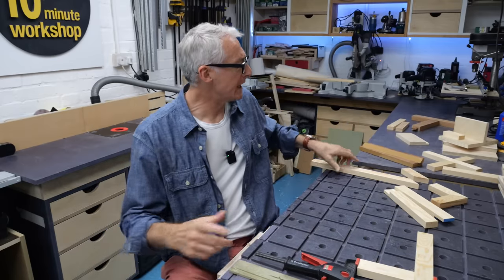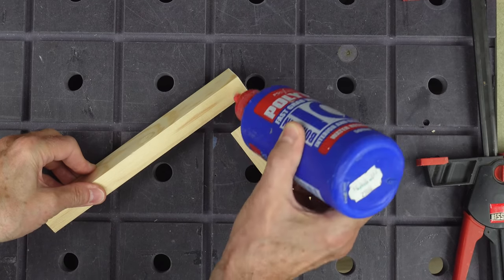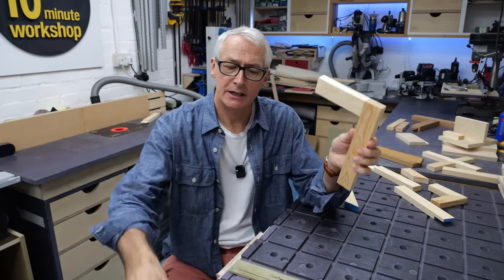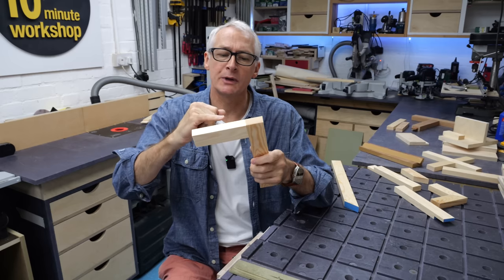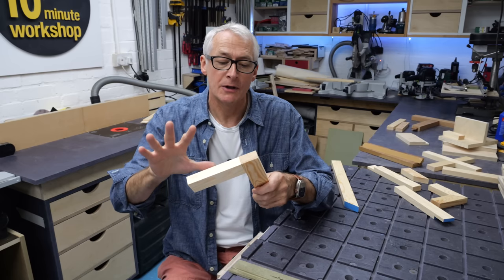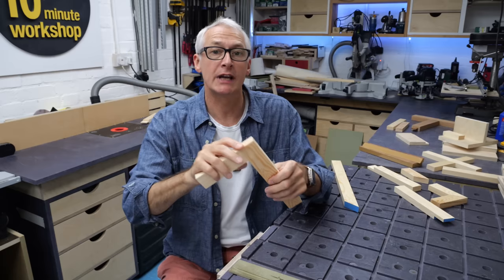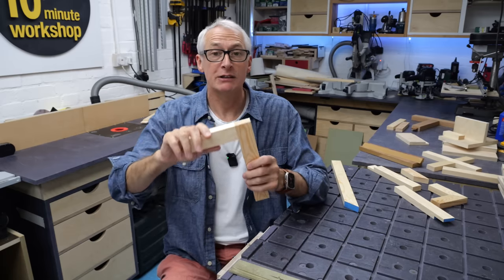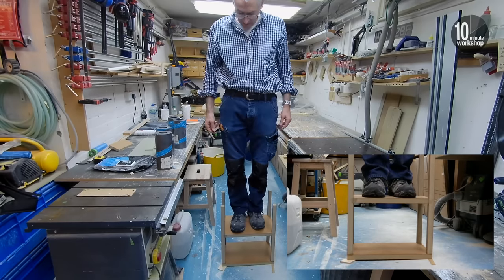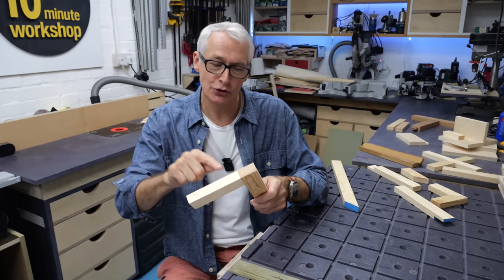So you want to join two pieces of wood together into an L shape, you want to make a frame, put a leg on a table or something like that. You get glue on one end, press them together, put a clamp on it, and once the glue's cured, there it is — strong as everything. Well, it's not actually that strong because you've got end grain glued onto long grain. In fact the only weaker joint is end grain to end grain, which is why you don't see that very often. This is actually surprisingly strong — I can't break that apart with my bare hands. This was glued yesterday. I actually did a video where I made a little side table that was just glued together this way, and I had to jump up and down on it to get it to break. So it's stronger than you think, but nobody would really call that joinery exactly.